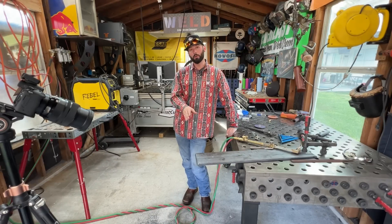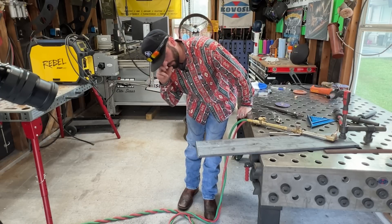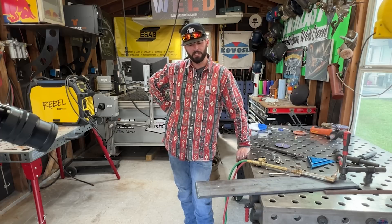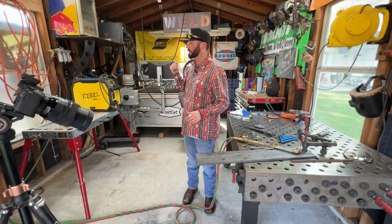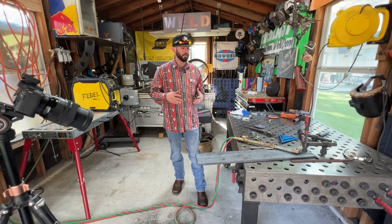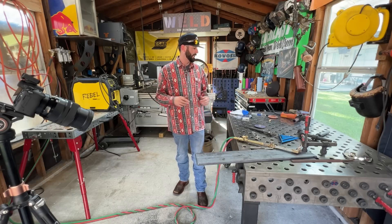That's more what I wanted to accomplish with the acetylene — it came down to travel speed. You need to move faster because that's what acetylene is all about: cutting fast. It cut a lot better than every previous result — hardly any dross on the bottom and a lot less grinding needed if you use the torch properly. But if you're like me and don't cut a lot of half-inch stuff, a plasma cutter handles that. Consider all these things when setting up a torch — the bottles and gas are the most expensive part. For me, propane is still useful because I can also cook cheeseburgers with it.